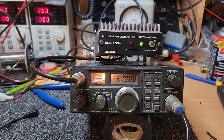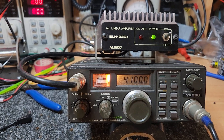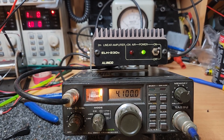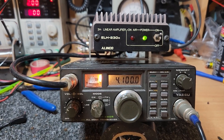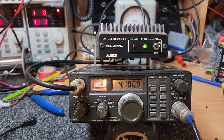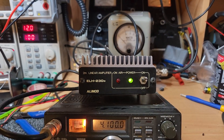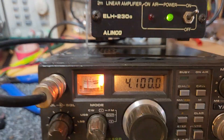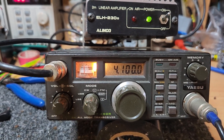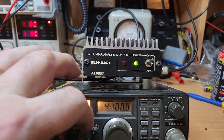Just a great little radio that doesn't cost huge amounts of money. Either the VK5 preamp kit, which was very popular if you wanted to run something externally on it, or internally the little Mutec RF front ends were really good little RF amps that did a really good job. Either way, you couldn't go wrong. This sort of video is more just to make sure it's all testing correctly. Let's just go to 144.1 and put a signal - yeah, beautiful. 144.1 sideband at 0.5 of a microvolt, minus 112 dBm - you're going to hear some stuff with that.